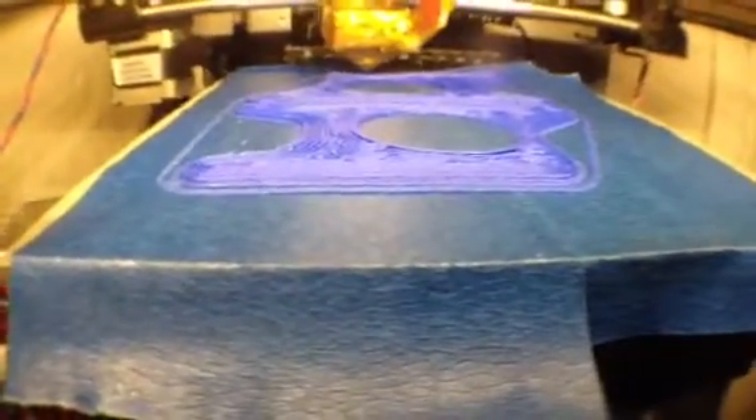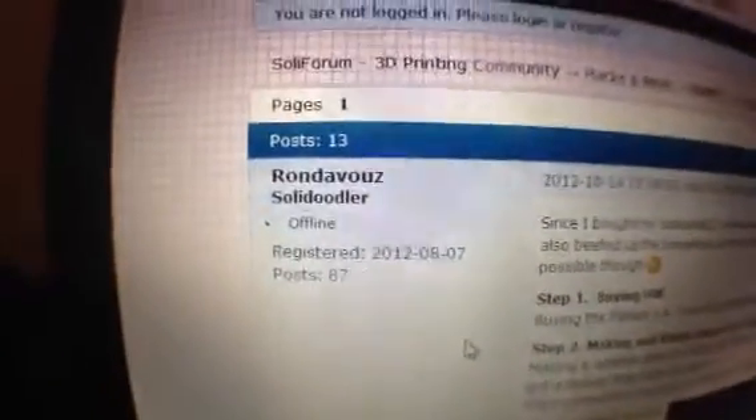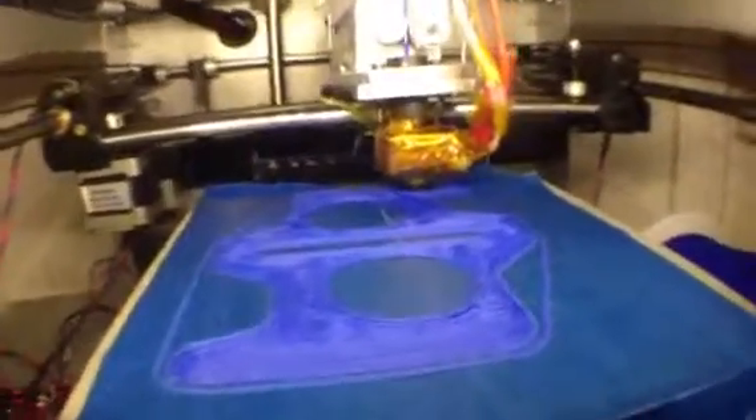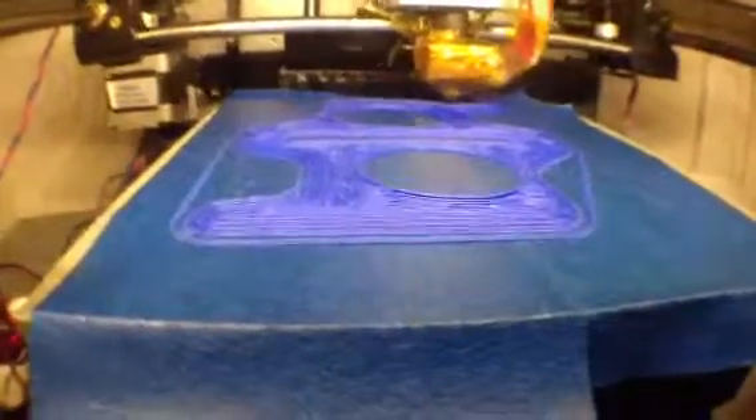The homing is quite tricky but doable. There's this guy who brags all up and down about hooking up RAMPS 1.4, but when you try to go get his firmware, you can see right there — he says you can't download it. I think that's kind of crappy. Anyway, I had to make my own firmware. Everything seems to be running pretty good. Also changed the carriage because the one they give you is crap.